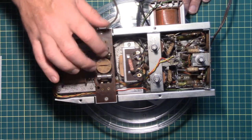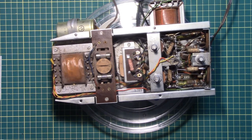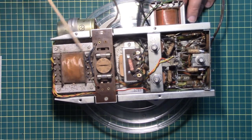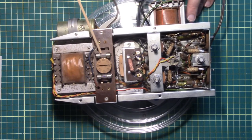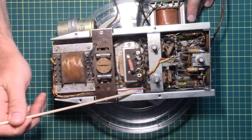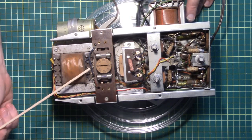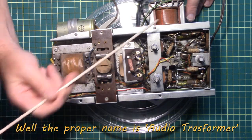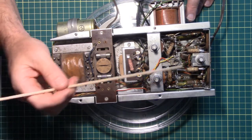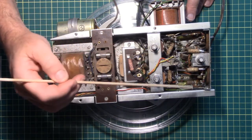Double fuses on it, as drawn on the schematic, which I have right handy. Let me get my pokey stick here so I don't have to stick my fingers in something. There's the transformer, which should be cleaned out a bit — I'll do that next. This over here is a bridge rectifier; who knows if that's good anymore. Then it goes from this main transformer into these two transformers — these are the left and right stereo transformers. I've taken the tubes out, and the two tubes go in here, here and here. So there's one amplifier on the left, one amplifier on the right.